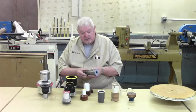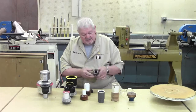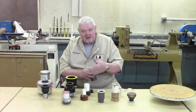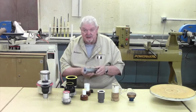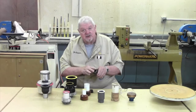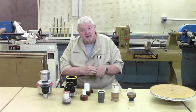These were made by a friend of mine many years ago. It's a standard nut welded to a piece of galvanized pipe — I'm going down in quality here as you can see — with a nice foam seal on it. Does this work? Yes. It's not very elegant, but it does seal tight. However, this nut doesn't sit tight to the headstock of the lathe; it requires a washer to get a good seal.